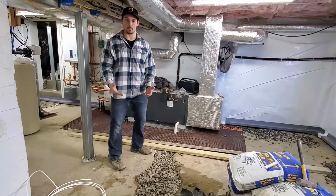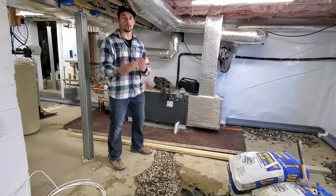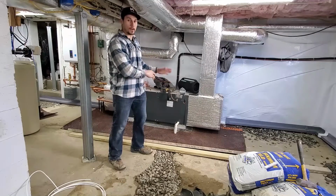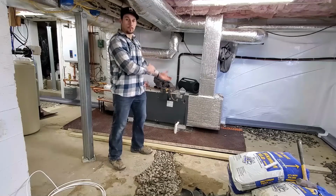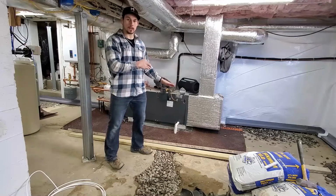But the basement still needs to be waterproofed, and it's completely impractical to have to remove something like this in order to install a waterproofing system. So what we do is first, we install drain mat around the area that needs the extra attention. We continue a lateral over to that space, and then we form and we pour concrete the day before our concrete trucks arrive. This way, if it's at a lower level, it's okay.